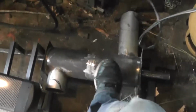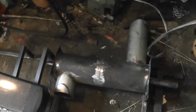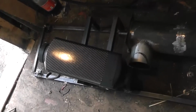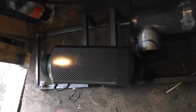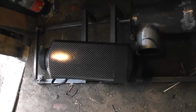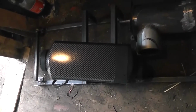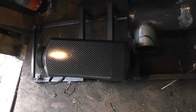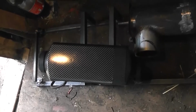Now I was wondering, should I put the heat exchanger on the air inlet? I was thinking, would that be a safer bet? But no, you're still running the same risk. And also, these Chinese diesel heaters are designed very accurately for how they work. This system is designed for cold air to be going into it, or maybe room temperature air. The whole system of the control unit has a thermocouple on the main aluminium heat sink. It has a speed control for the motor. It has a frequency control for the fuel pump.